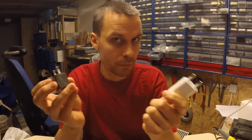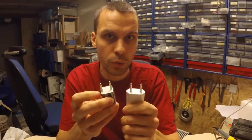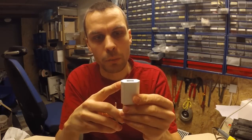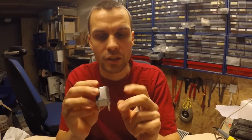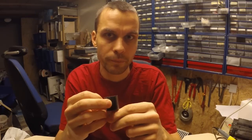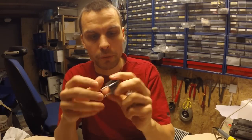There are different models available — these ones have an EU plug, you can also get them with a US plug. They're usually rated from 100 to 240 volts input. I prefer this model over the other one because this one has one PCB with high voltage and 5 volts on the same board, while the other is actually two PCBs — one for the 220 and one for the 5 volts — with cables in between. We'll go through this in a minute.